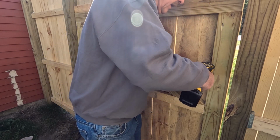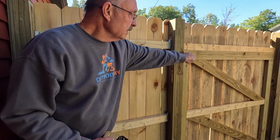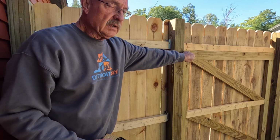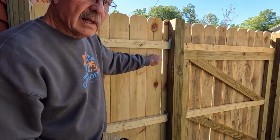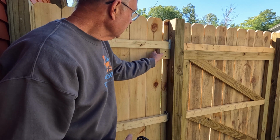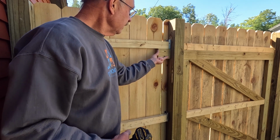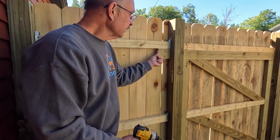And then the same thing down here. My hinges are going to get installed the top and bottoms with the center of this 2x4. So when I come over here, I'll have 1 lag bolt with nothing to grab a hold of. So I'm going to install this little piece of 2x4 right here with some pocket screws so that that lag bolt has some material to dig into.